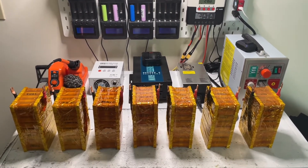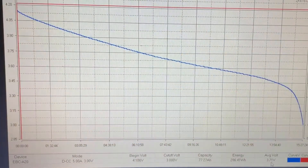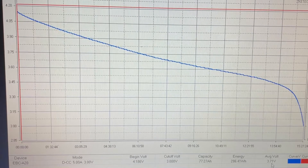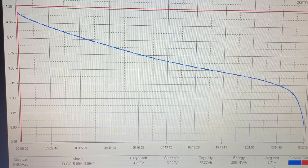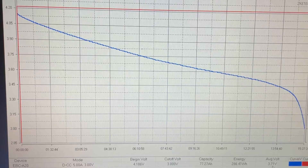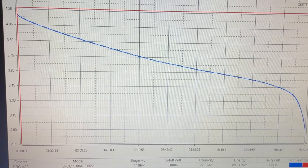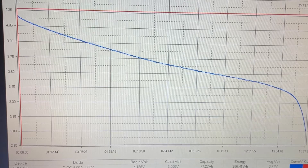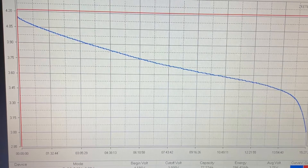Let's have a look at the graph and I'll explain why. From my battery testing video, the voltage curve of the 18650 battery is really smooth, starting at 4.2 volts all the way down to about 3.35 volts where we get a sharp drop off. We know we're never going to go below 3.35 volts because it's not practical. So since we're not going to totally discharge these batteries, we don't need to bottom balance them.